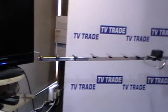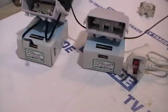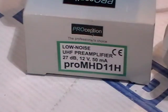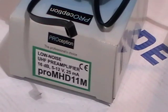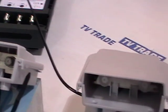One thing to be aware of is that when you amplify the signal, there's a possibility of amplifying interference as well. So if there is background interference in the area being picked up by the aerial, by amplifying it we will pick up more interference too.